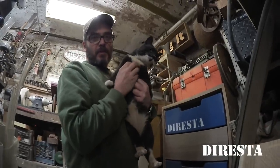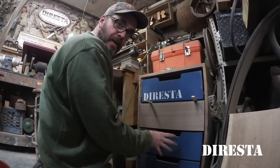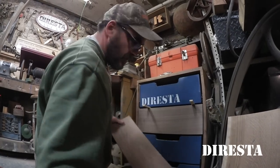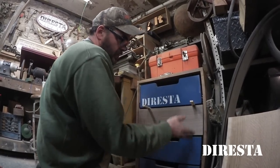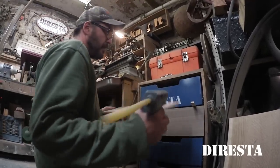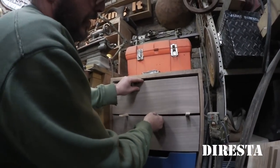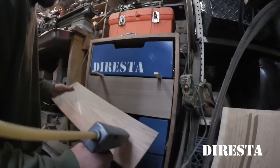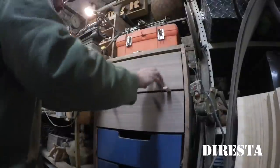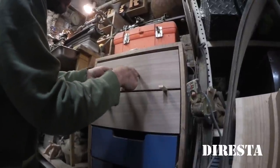Here's another glue tip — Spike's going to help me with this one. Whenever we attach drawer faces onto drawers that are in place in a cabinet while we're building them, I like to hot glue the drawer faces in place until I'm able to get the screws in from behind or place the holes for the handles. I've already glued this one in place with hot glue. If this is my clean perfect drawer face, I space them apart sometimes with shims to make sure I have enough area for even spacing. Then I put a dab of hot glue and place it gently until I get the air space I want around it, then gently push it into place. The strength is ultimately provided by the screws from inside and the handle screws going through the center.